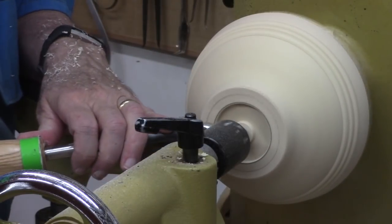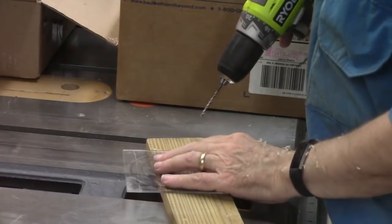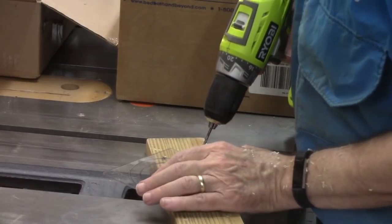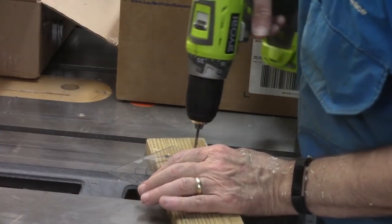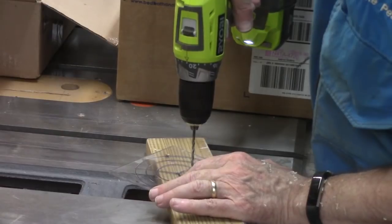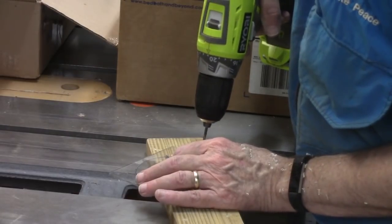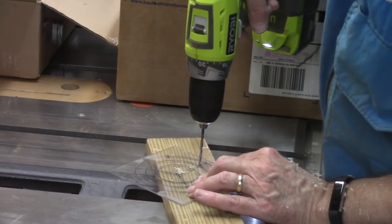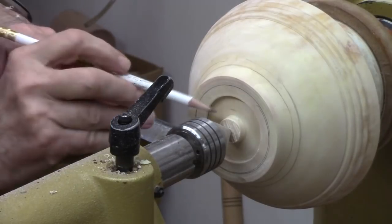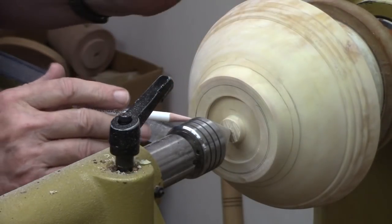Now I've got to flatten this out because it wasn't flat. Thanks to longtime viewer Glenn Crandall — in my earlier video where I used a larger template and was having an awkward way of having to mark it, he suggested why don't I drill holes at the intersection of the 60-degree lines and in the circles. I thought, wow, that's a fabulous idea. It makes it much easier to mark it with a pencil. It was important that we left this hole from a live center to make it easy to square up and true up this bowl when we mounted it on the vacuum chuck.